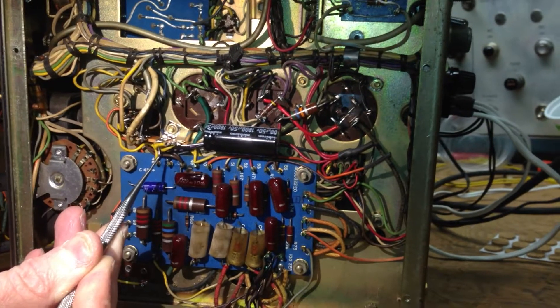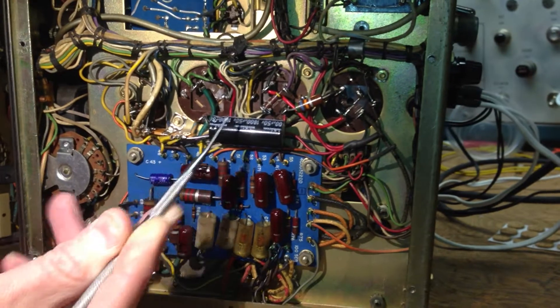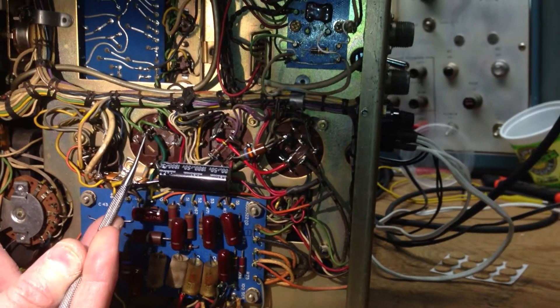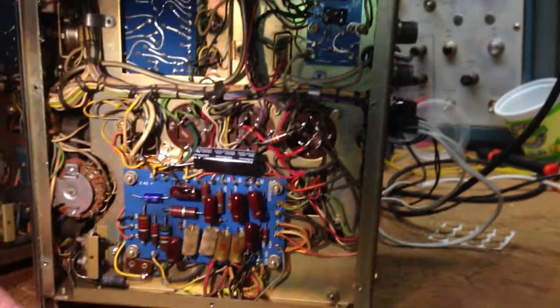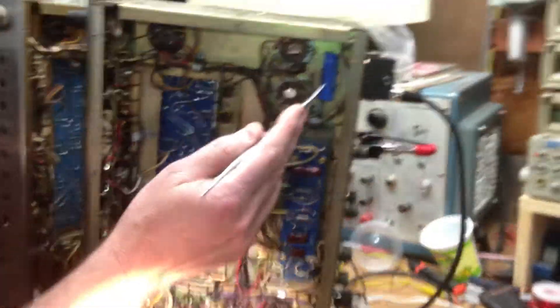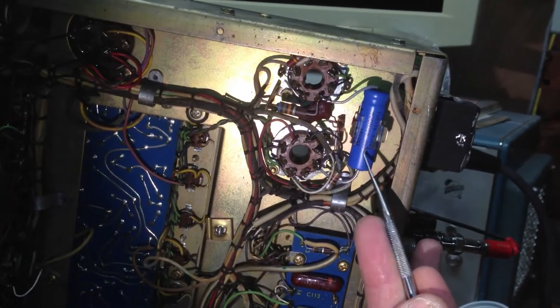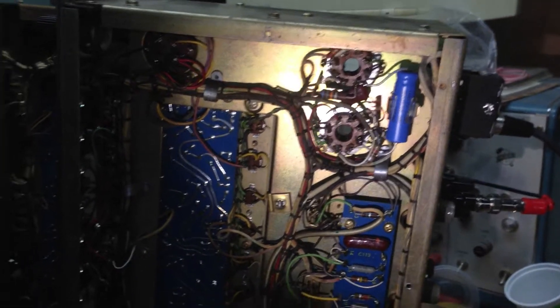The heavier yellow wire is the heater supply choke, which returns in the green-sheathed wire to the original location for the second capacitor. That gets the heater supply into the proper operating range. The capacitor up here was replaced with a modern 5-microfarad unit; vinyl tubing split was used to allow the original clip to hold it.